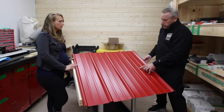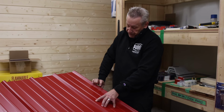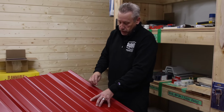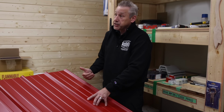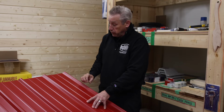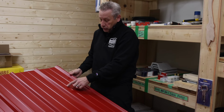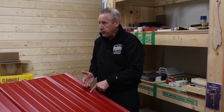And basically from here, where it gets a little tricky sometimes is if the end fascia here and the rib has to get cut off. If it's cut off, okay. What you may want to do though is have this piece folded up a little bit to create a tight socket in that flying gable. You leave it down, but if you leave it down, this is now going to want to wobble a bit. So some will put a fastener on the edge. Again, it's in the flat, but it's okay.